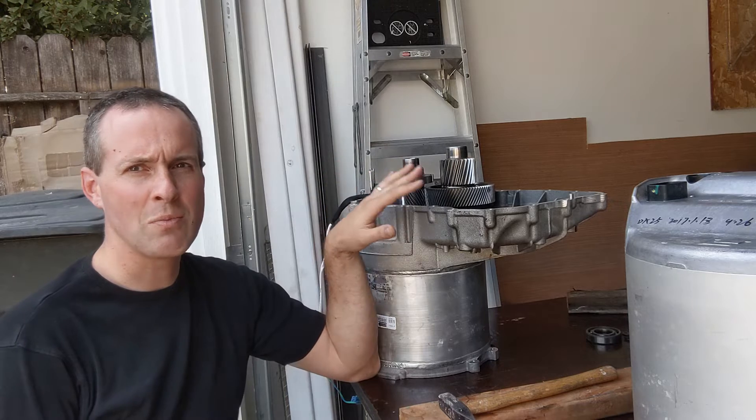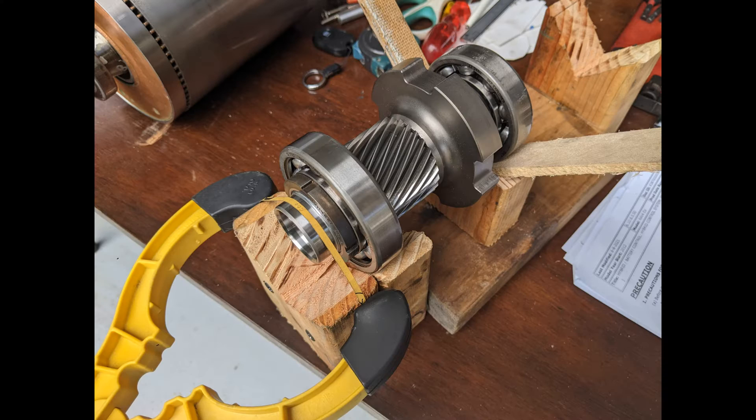In this episode we are going to assemble the drive unit back together. We also sanded the shaft with 600 grit sandpaper only in the shown location in order to make the shaft roughness the proper value for the seal.